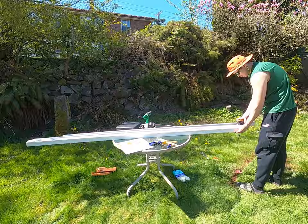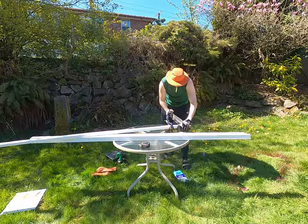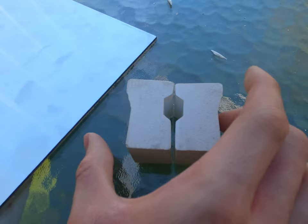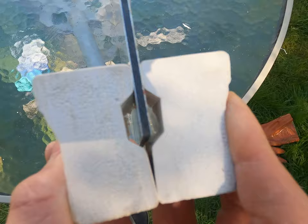I made sure they were all the same length. I need four pieces of this 8 foot long PVC molding because two pieces will be fastened together to pinch the max metal screen in between. With that being said, I can't have the two moldings directly making contact with each other and drill holes in between. I have to use my max metal sample and account for that spacing to make sure I maximize my contact in securing the screen.